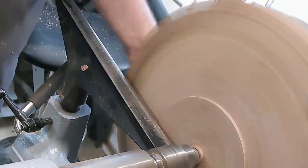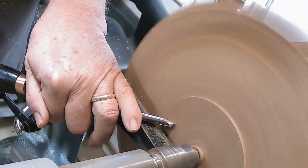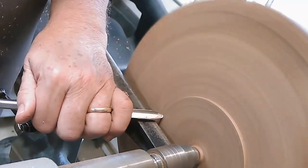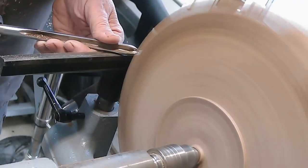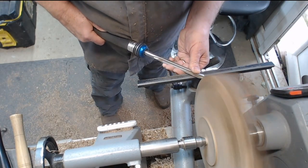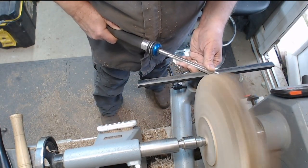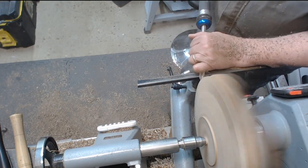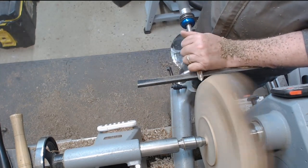So a bit of care now whilst it's easy to do, leaving a small nub in the centre which you can't get to and you've got to sand off or take off with a chisel. Now time for some more reprofiling around the edge where the bark is a bit dodgy, so I'm taking it as carefully as I can, and trying to profile it so that I've got a nice shallow dish.